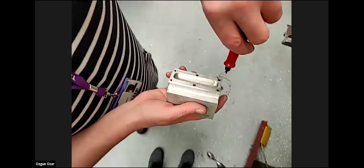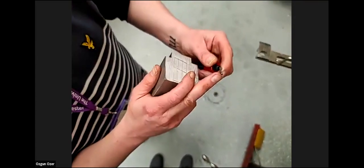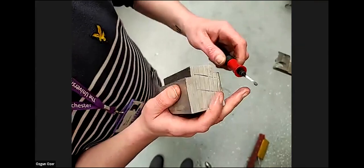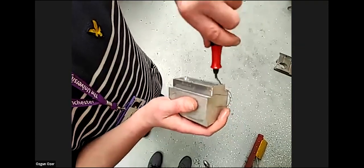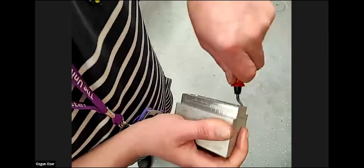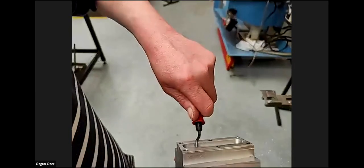But you showed before that this tool is also very good for the holes, right? Yes. You can put it in the hole. It's a bit difficult because it has a bit of a ball on the end, so it's not the easiest tool to use. But you can buy separate blades for holes for different applications. So you can do it, but it's not really the best method of getting a chamfer on the hole. Pocketing, yeah, we can do it on the pocket again.